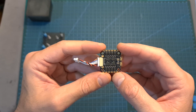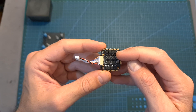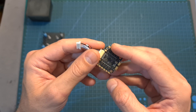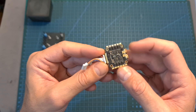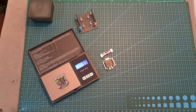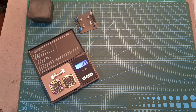As for the 40 ampere BLHeli 4-in-1 ESC, it features an onboard current sensor, it can be powered with between 3 to 6S batteries, and the soldering pads for the motors can be found on both the top and bottom side of the board. In addition to the 8-pin JST connector, you can find the matching soldering pads on the bottom of the 4-in-1 ESC. Individually, the weight of both the flight controller and 4-in-1 ESC is 5.9 grams, and together along with the JST harness, their total weight is 12.4 grams.